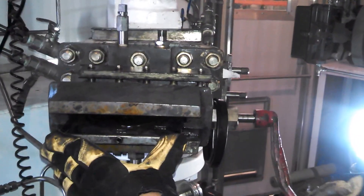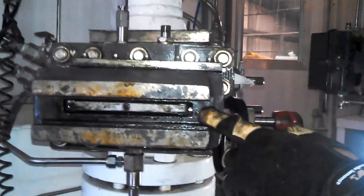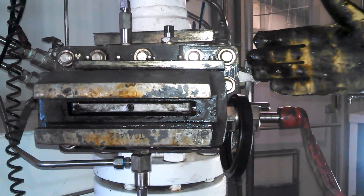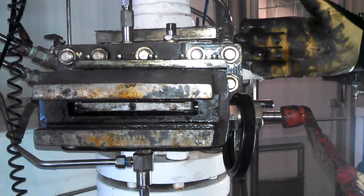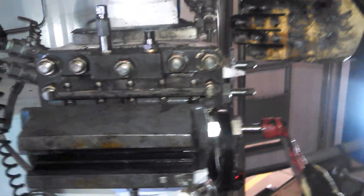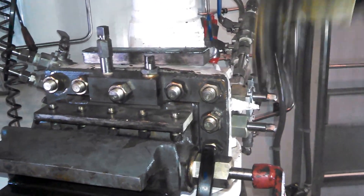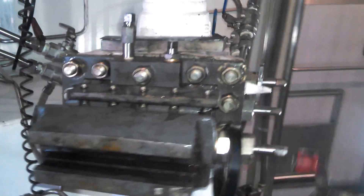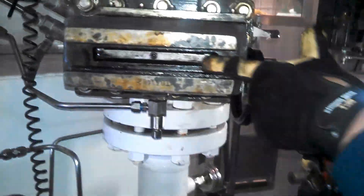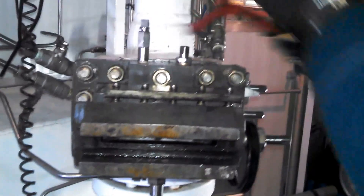We'll reinstall our plate and bump it back in. When you roll it in, make sure it goes flush — because if you go too far, it's going to bump up against the gate. The gate is held by positive pressure and springs, so when you bump it, it's going to push the gate back and allow pressure to blast out at you. Make sure you bring it in flush so you can get your gasket and block-off plate back in.